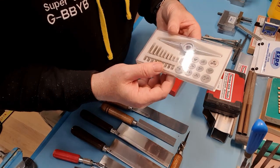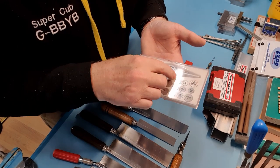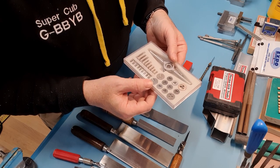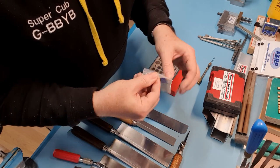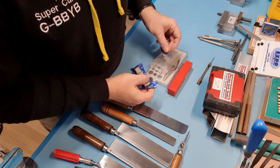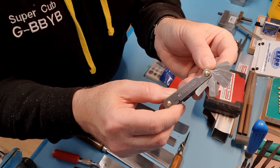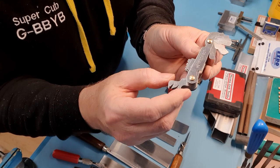With drilling holes you tend to want to put screws in, so here's a small tap and die set. I mostly use metric nowadays: M2, M2.5, M3, and M4 are the sizes I use. You've got to remember that some sizes use a different pitch, so you need to be careful. That's where a thread gauge comes in — this one has just about every pitch you can imagine.